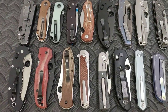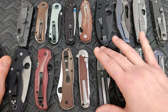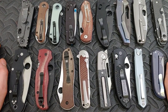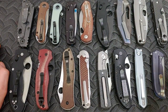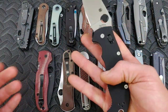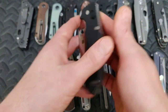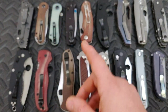So what do I think is the best all-around edge you can put on a knife? In my opinion, a 17 degree angle at 1500 to 2500 grit is the best angle. A 20 degree angle is also great at 400 to 800 grit. Since the 17 degree angle is finer, you can get away with a higher grit — even a mirror edge — at 17 degrees.